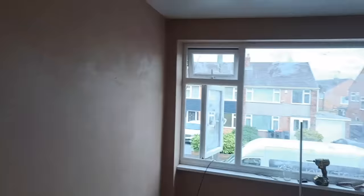And you can see now that there's little dark patches starting to form like here. So that's how I know it's basically ready. It's near the end. It just needs a good hard trowel and a quick flick over of a polish, and that will do us. Okay, we're on the last wet trowel now. Then after this, it'll just be a polish.